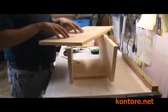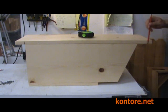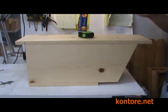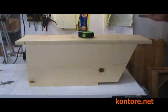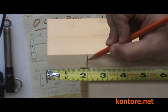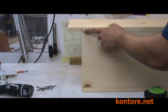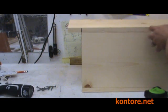Next, we're going to attach the back to the owl box. You'll notice when you lay the back in place that the back lumber will overhang on both ends. There's a reason for this overhang — this is where the unit will be attached to the tree. There'll be two holes drilled in the bottom and two in the top, so we need the overlap. Toward the bottom of the owl box — the flat part, not the angled side — make a mark on the back about two inches from the end, allowing two inches of overhang. Align the back to the bottom side edge so that the two inches is overhanging. The exact distance is not critical, but it should be within a quarter to a half an inch.